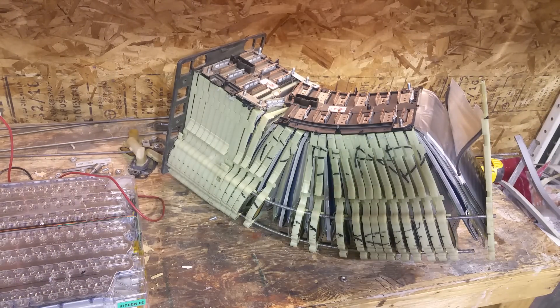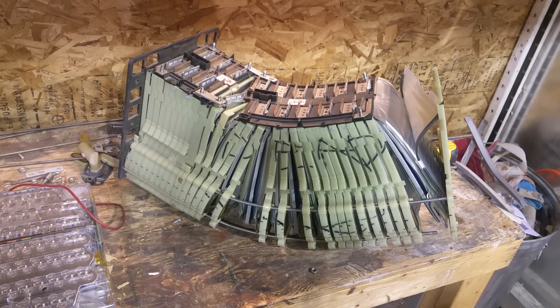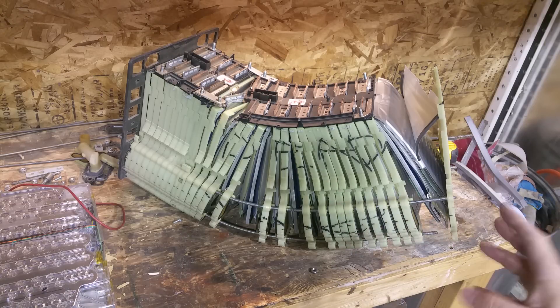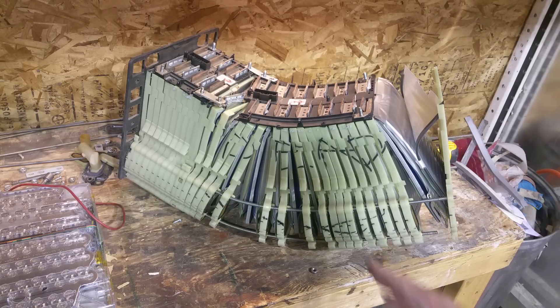This one still should be a perfectly viable module. So maybe you're wondering why the heck is this happening. When you fully discharge cells or overcharge them, you start getting unintended chemical reactions, and those result in a state change that requires more volume than was there originally — as a result they swell. That pressure needs to go somewhere. In this case, with the way the pack is designed, the rods hold everything together. When I released that, the pressure was relieved — and that's the result.